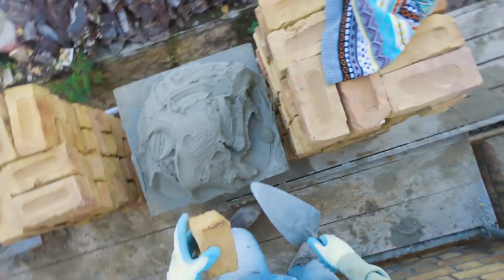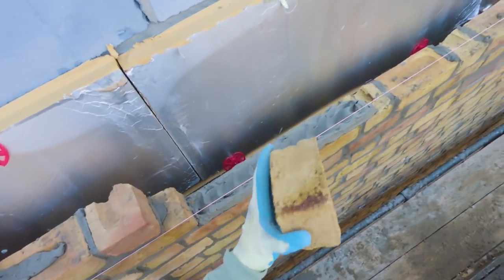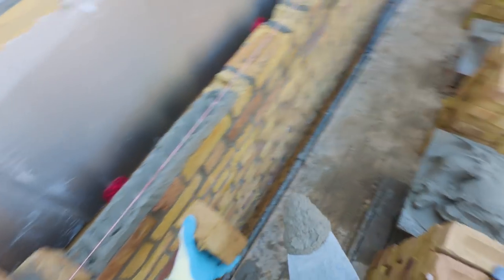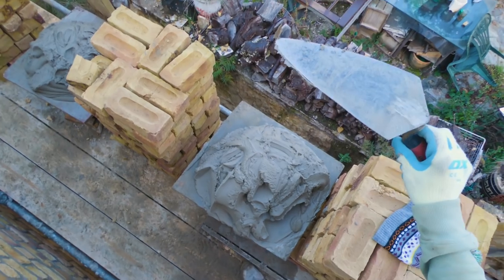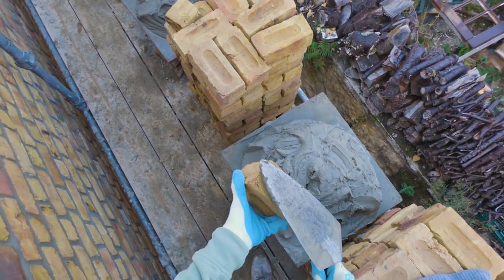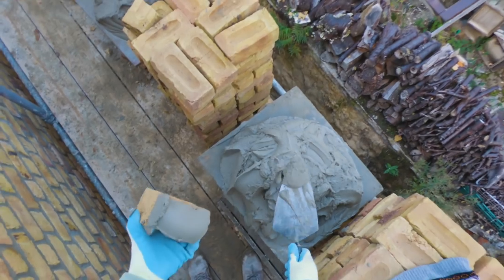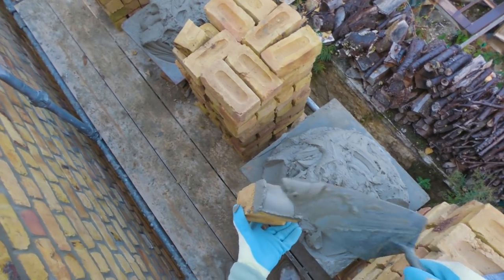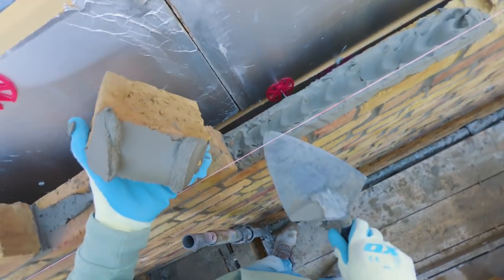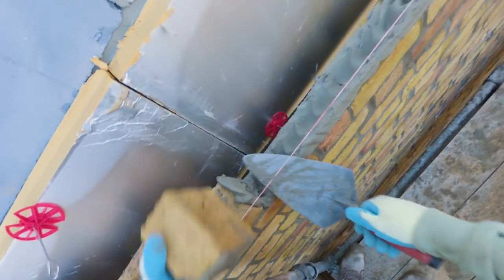Get one of the bricks we cut and butter it up. Hold it from the parts you won't put muck on, and look at where you're going to put the mortar — you need it on this side. Get a bit of muck on the trowel and flick it so it stays on when you turn it upside down, otherwise it'll just roll off. The action is top to bottom, then sideways, top to bottom again. You might need a little extra flick on the bottom, then top to bottom again. When you put it in, these ridges should be a fraction higher than where it's supposed to be.